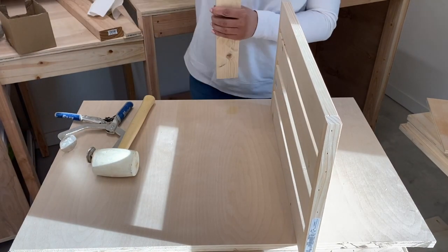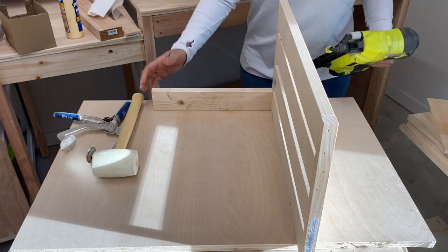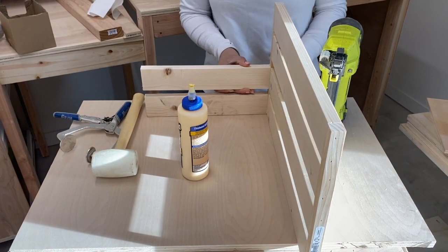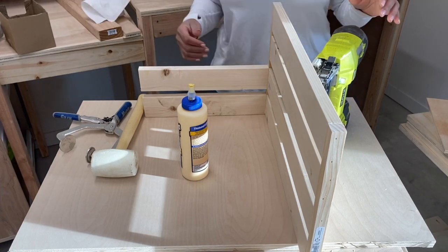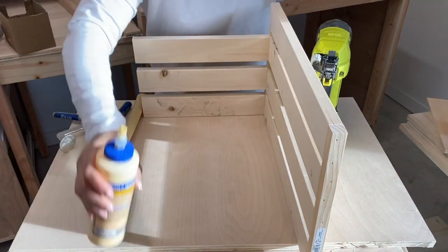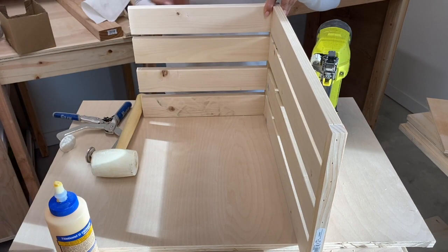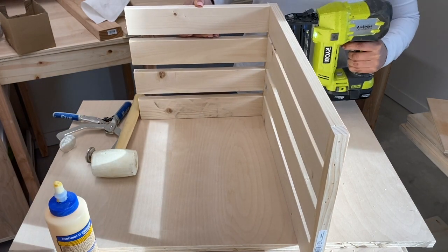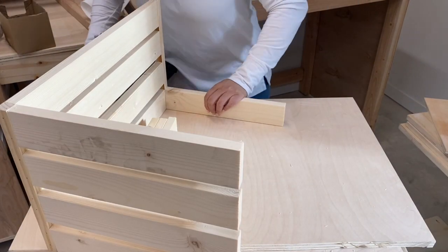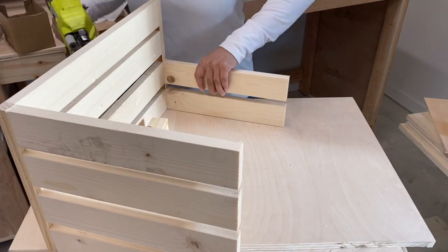So now that I have that side finished, I'm going to begin working on the short side of my crate. You put this side together just the same way that we did the long side, except you may need a second set of hands to hold those boards. I managed by myself, but a second set of hands would have really helped. You're just lining those short boards up with the long boards, and nailing it into the opposite end of that 3/4 inch dowel.